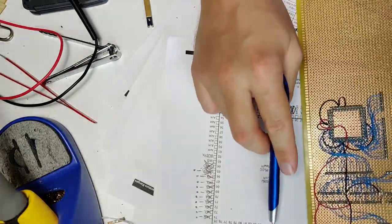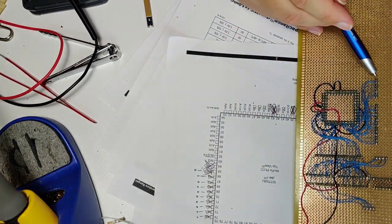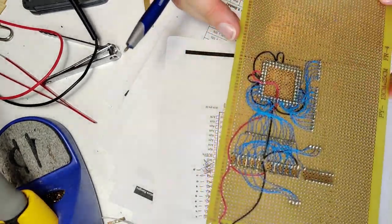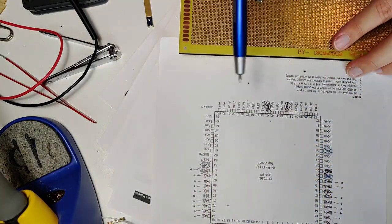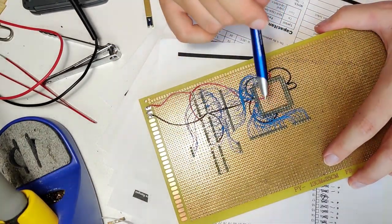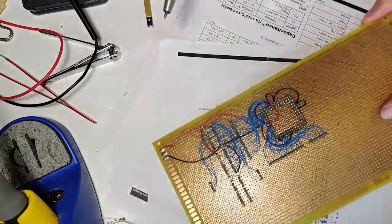And then we've got our control signals from up here. Those are all coming down over here, most of which are next to each other right here, except for the busy signal, which is over here. So, at least for prototyping and testing purposes, as far as the build of this board and soldering, I think that is everything for the video side. Obviously, in the future, this will be hooked up to the CPLD, which will be driving the output. Obviously, there is another video RAM that needs to go in here that will be wired up exactly the same way.